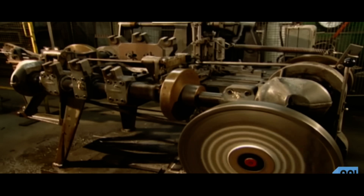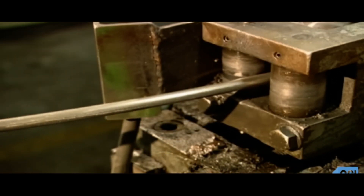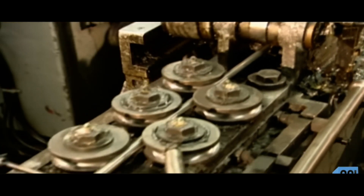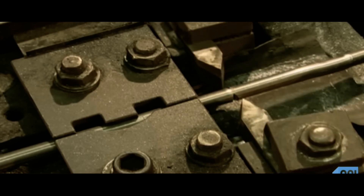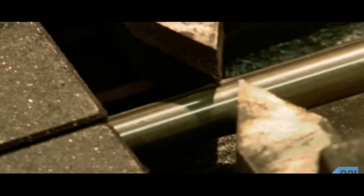Another forming machine makes a chain that can haul a heavier load. A grip pulls the wire onto rollers that straighten it out. Steel cutters then make notches on both sides of the wire, marking the place where the wire is to be sliced into link-sized pieces.